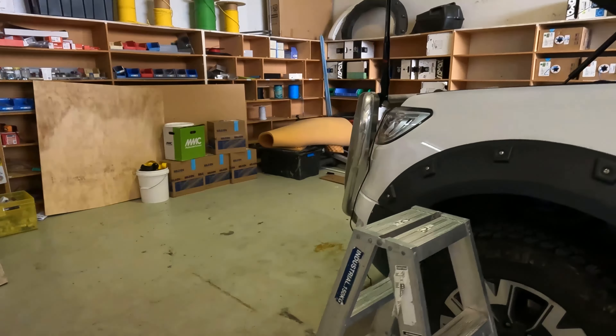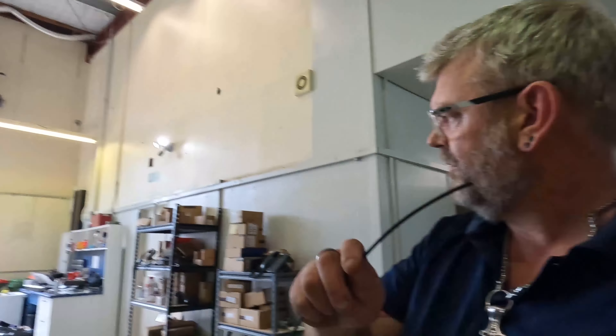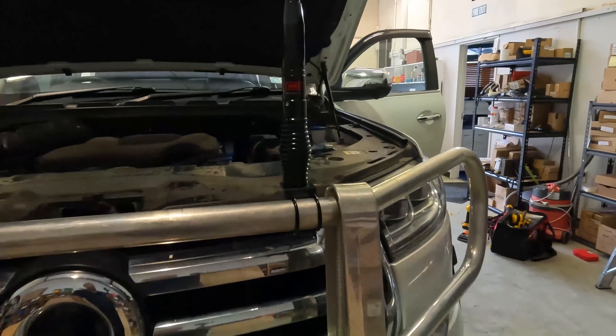This is now the third cable I've punched through this rubber grommet. I get some heavy wire like this — it's called catenary wire — push it through, then tape the cable onto it.